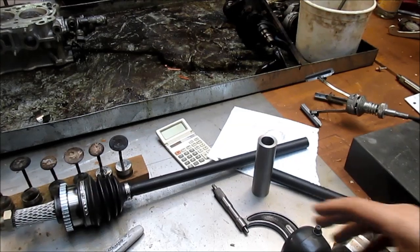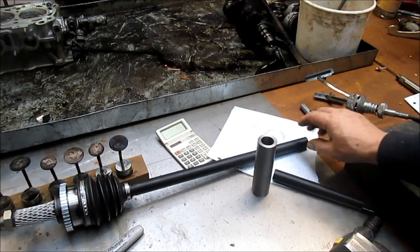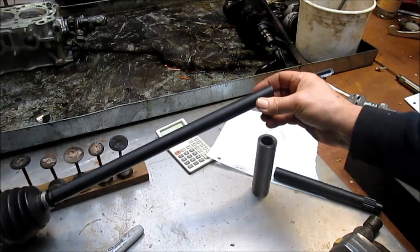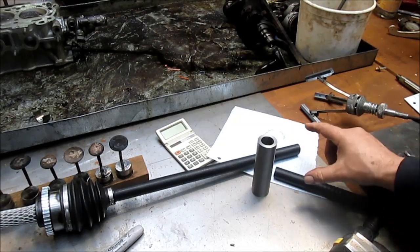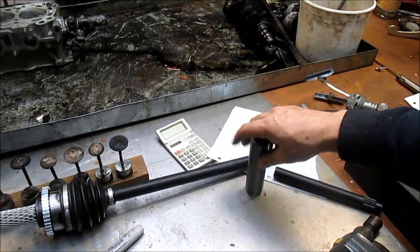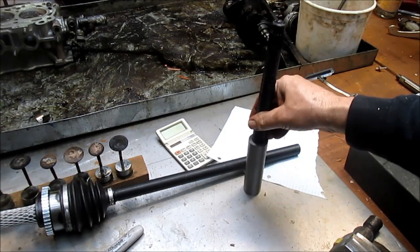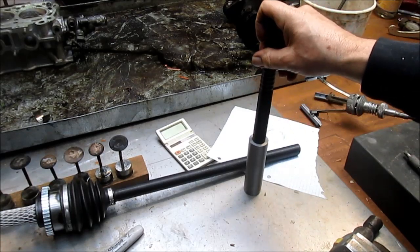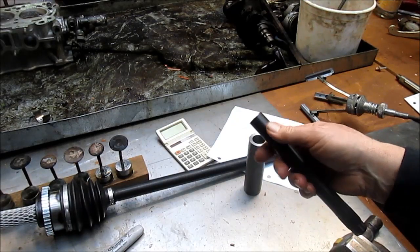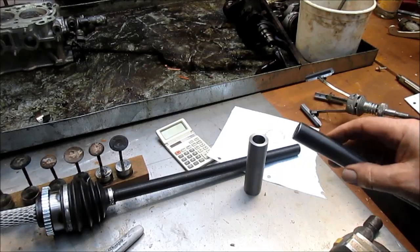All right, we cut the shaft in half and that was quite an effort. It must have taken 20 minutes to get through that thing. My blade never goes crooked, and look at that — it just took off and went south on me. But we've got an inch or two to cut out of that, and then we're going to put this on the shaft and splice the shaft together with this sleeve. We're very close. I haven't taken my measurements because everything's still pretty hot, and I think we're close enough that we're going to be able to just slide it in there. Worst case, there are some pretty rough tooling marks that I might be able to file down on the lathe a little bit.